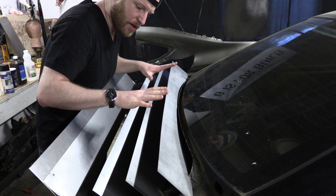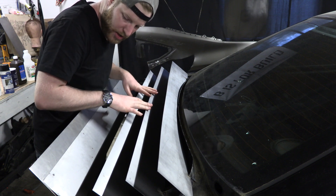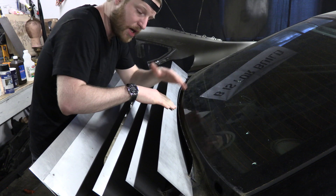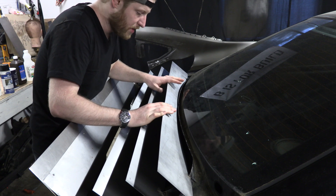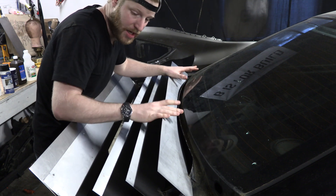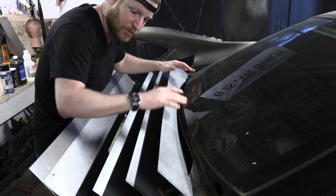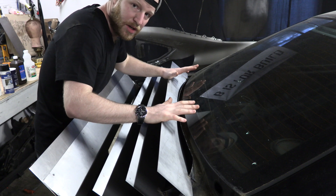Alright, so we got our steel here and a lot of times when you're working with steel you can get grease that comes off of your hands and other things, and to get this stuff to stick and dig into the metal you can't have grease. If you spray on top of it, the grease will make a barrier between your spray and the metal and that spot won't rust like the rest of it. If you're at home and don't have any way to degrease, you can use fire, sanding, or scrape the metal down bare. But I would use degreaser — I have some paint prep degreaser so I'm gonna spray all this down and then we're ready to apply our mixture that's gonna create rust.